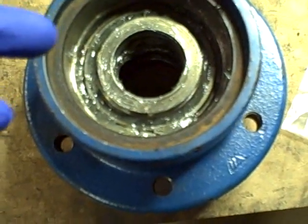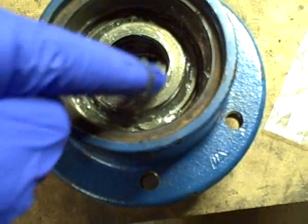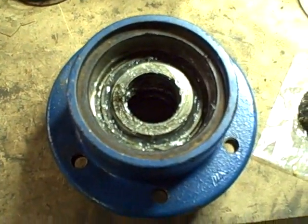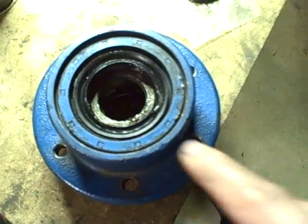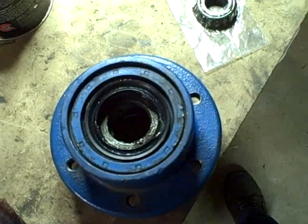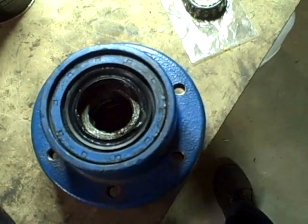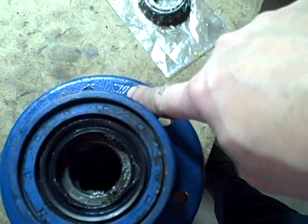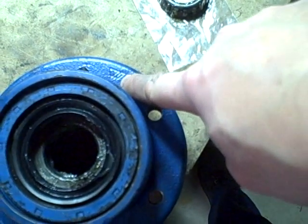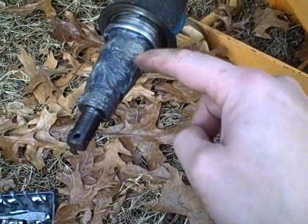Use a small brush to get grease on the inside of the hub on the inboard side, put the inboard bearing in, then stick the washer on the back where it goes — it'll be held in place by the sticky action of the grease to help align it when sliding it on. Now I put the seal back in on the backside. The spindle has been cleaned and inspected for damage — it looks fine. I'll put a coating of grease on the spindle and slide the hub on. There's a logo stamped on the inside of the hub, probably the manufacturer.